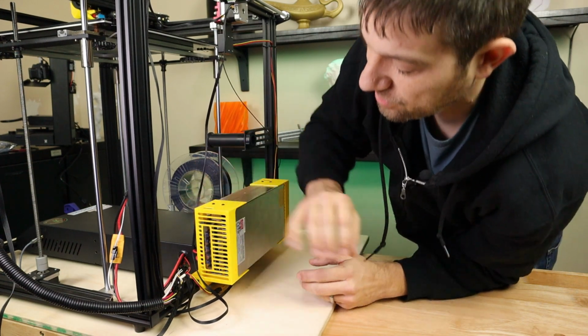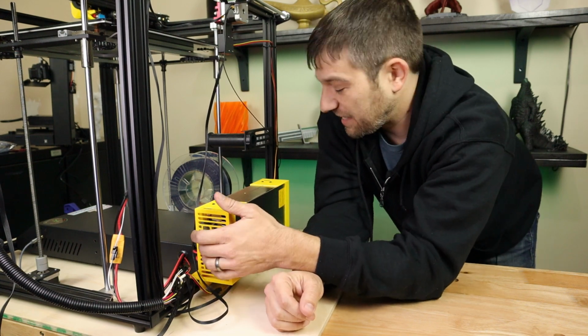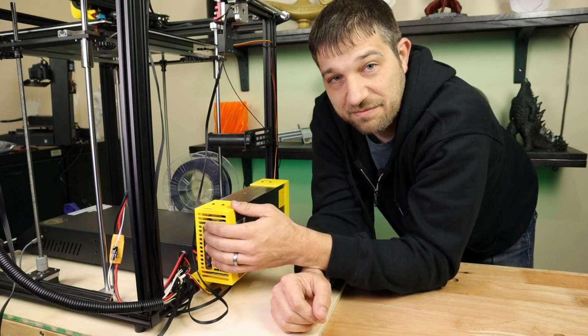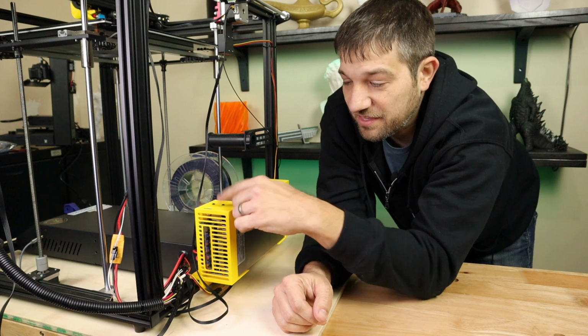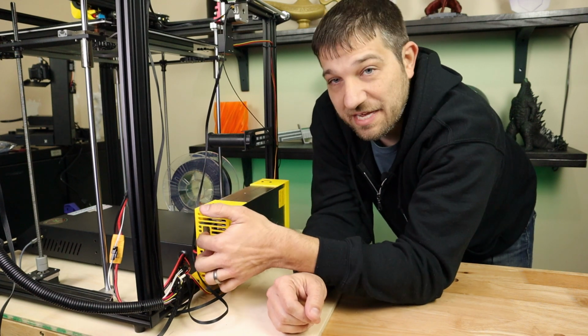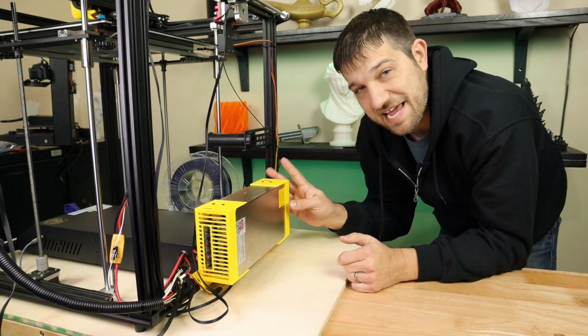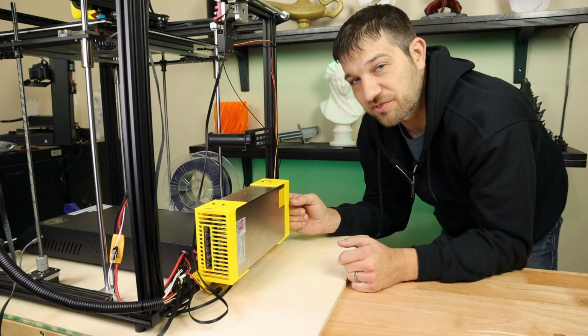Obviously, I wanted to make sure it was safe, first and foremost. With these electrical components exposed on the front and back, it could be a hazard. You want to keep these covered. It comes with these nice plastic strips in here that I showed installing. Please reinstall those on yours because it keeps you from sticking your finger in here, particularly on this backside, which is the AC side. These wires are going to be live AC. You need to make sure they're covered.